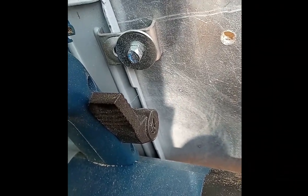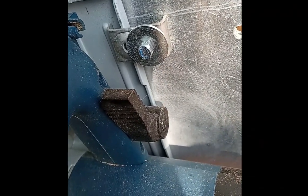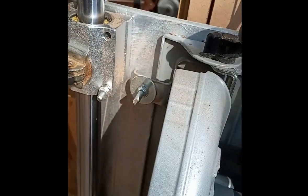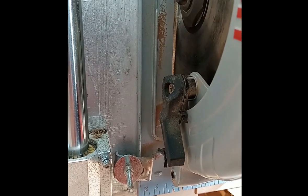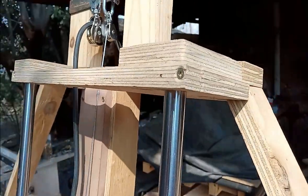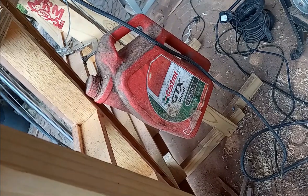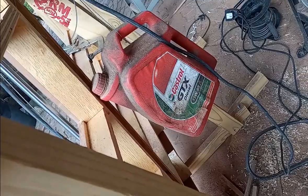Fitting the saw. I'm not sure where these brackets came from, but I must have picked them up sometime and put them to one side — and lo and behold, they've come in handy. You can put a spacer in between your bearings that's the same width all the way along, and all you have to do is hold that in between the bearing faces and the foot, then tighten up the four clamps. The plate has a counterweight that runs up to some pulleys. The counterweight at the moment is an old tin of Castrol GTX, but I'm having friends at Free State Metals sort me out a smaller weight that's about five kilograms.